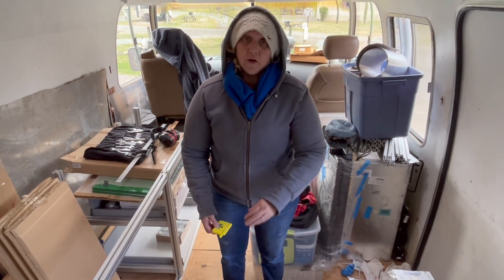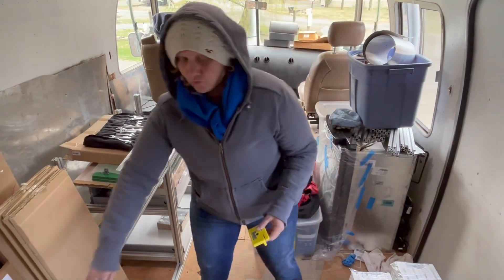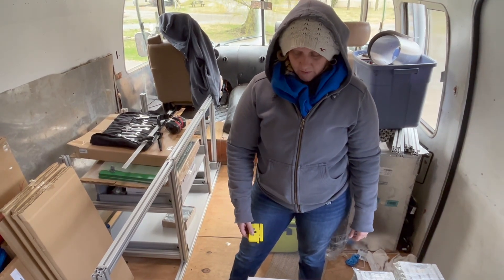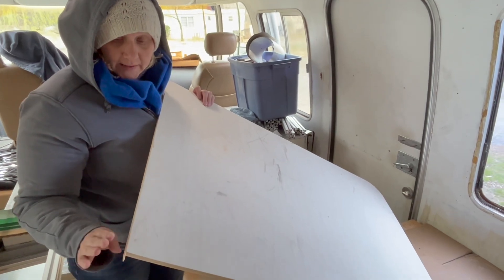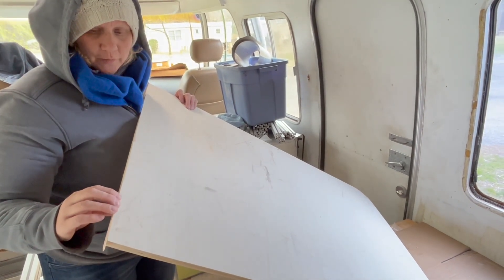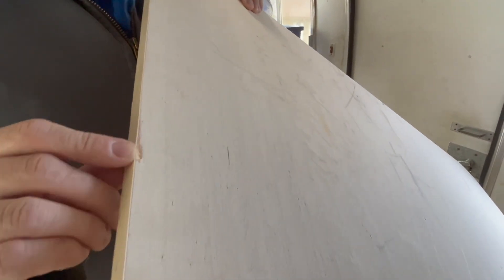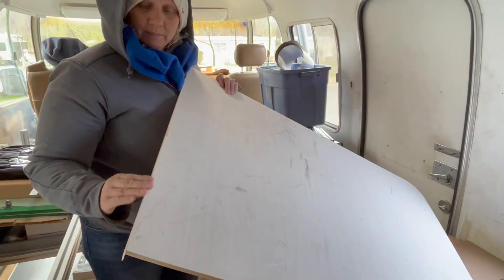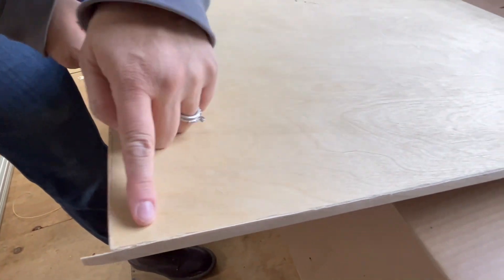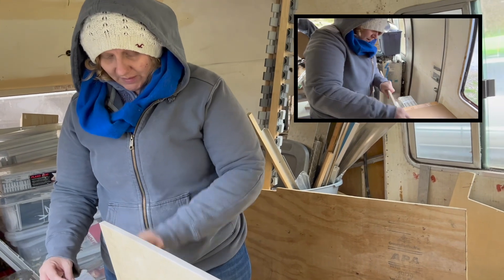I really want to learn how to do it well on this experiment so I can do it better when I have the sides of Dreamboat's cabinetry. What I've learned is that I need to make sure when applying this that it's more centered. I also need to make sure my pressure isn't too far down into the substrate because it'll peel off the veneer on the plywood. I've gotten better — this is a much smoother cut on this side than the other side, which is pretty wonky.